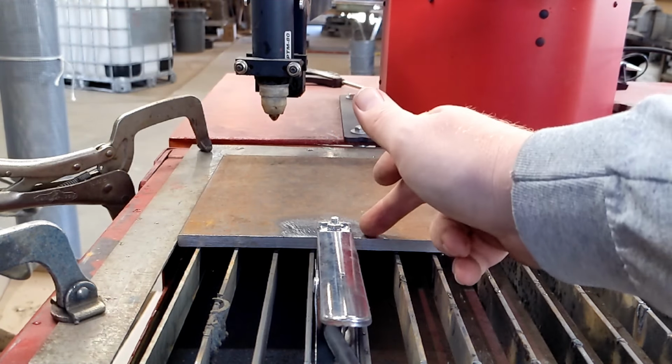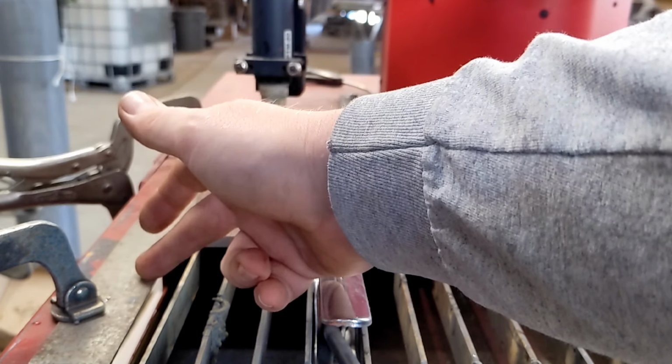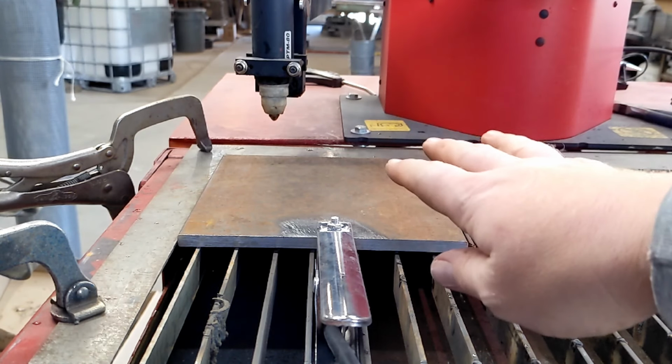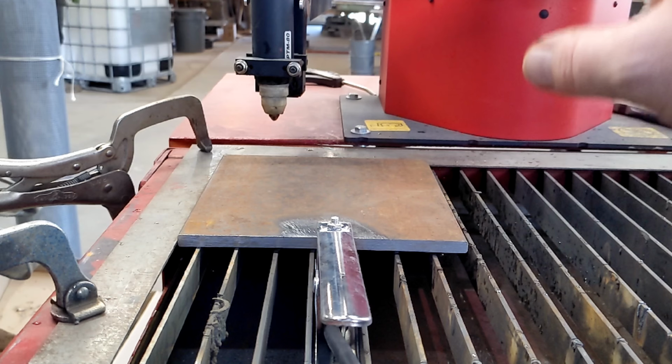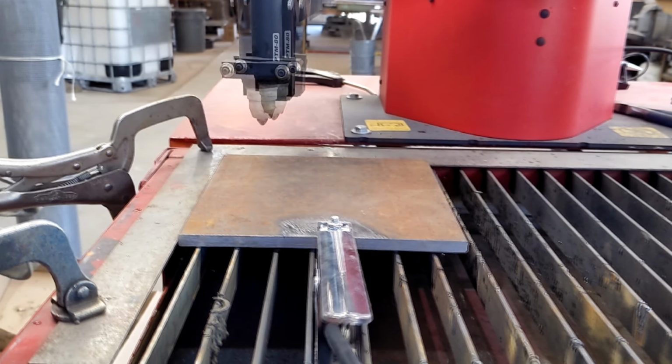We have polished our material to ensure that we get a good ground. I put a secondary clamp on my L square here to keep everything rigid. Now we're going to cut all 4 holes. The plasma cutter is set up at the proper amperage and the unit is all set and tuned to run at the correct speed. We should be able to cut now.